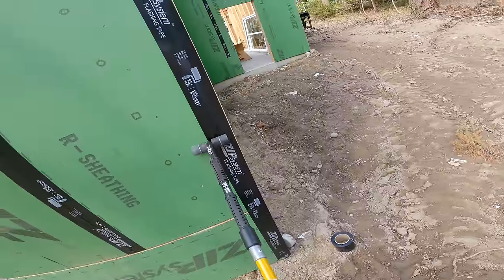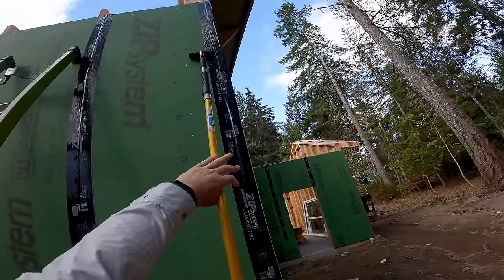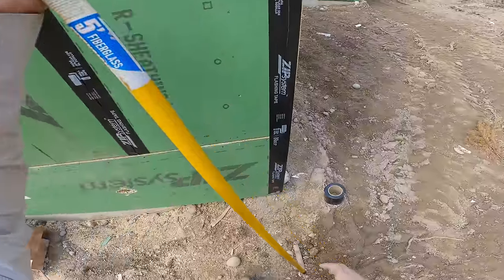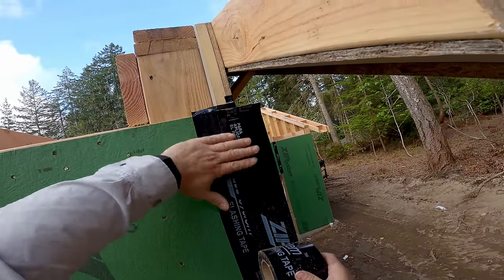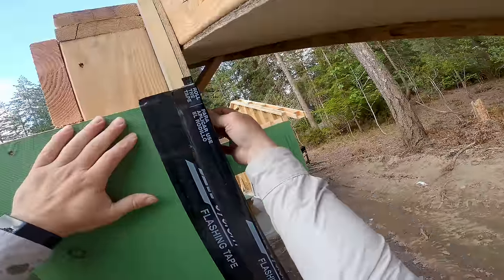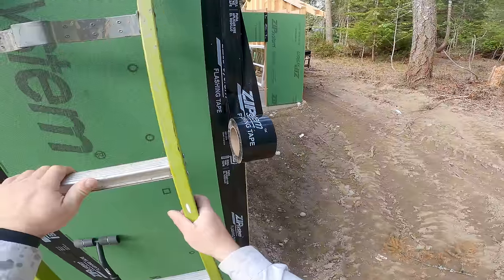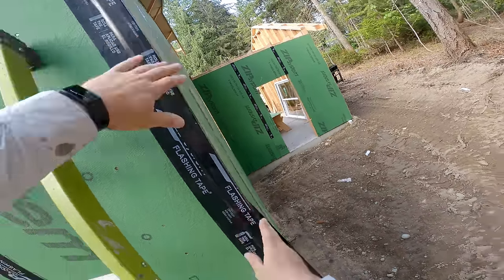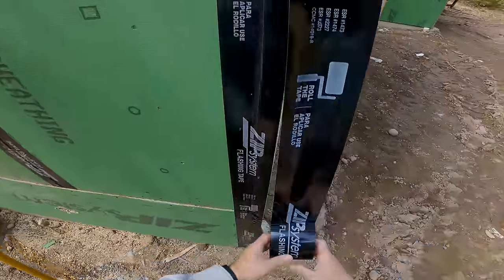Pro tip: make sure that you put your J roller on a painter's pole — I'm able to reach all the way to the top without getting back on the ladder. Here's the trick I use for layer number two: I use the edge of the poly ISO as a guide. We want a minimum of one inch overlap on the tape and at least one inch lapping around the corner onto the zip panel itself. By using the edge of the poly ISO, I have a nice straight line to follow all the way down — that gives me an inch and seven sixteenths overlap on that side and the remainder on the opposite side. I work in about three to three-and-a-half foot increments, smooth the tape, wrap it around the corner, cut it off, and roll the tape.